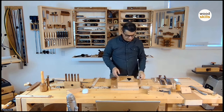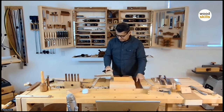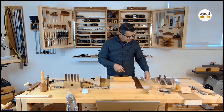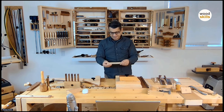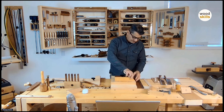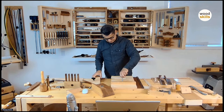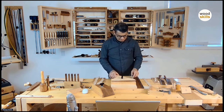My most recent go-to shooting board — I'll show you what I've done with it. This is one of the original shooting boards with left-hand orientation that I created for the Fine Woodworking article. This attachment does case miters — here's an example of a case miter at 45 degrees. This would be used for a small compartment, a box, or a drawer, so it's important to have corners at 45 degrees, which is accomplished through this attachment. When I'm not using the attachment, I can switch it up.